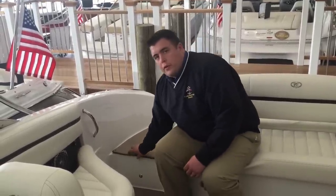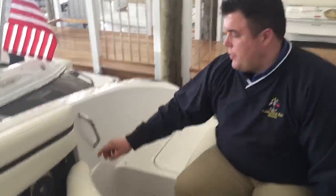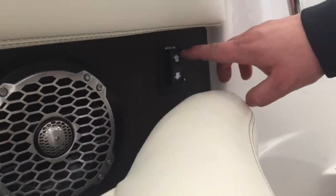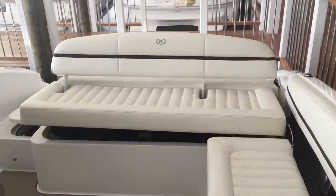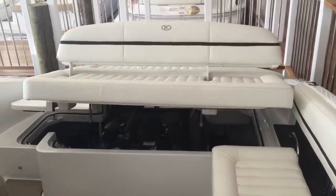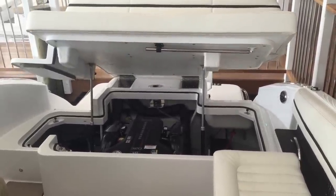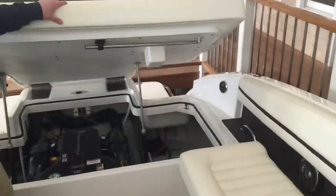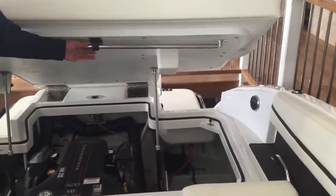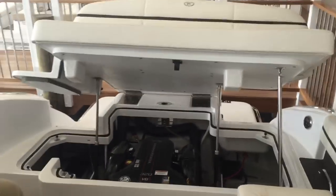Next, we're going to cover the engine compartment. If your boat is outfitted with the optional walk-through carpeting, make sure that it is unsnapped and removed out of the way prior to that. If your boat is equipped with a motor box actuator option, your switch will be over on the starboard side. Simply to raise it, push your finger on the up position and wait for it to rise up. Once the engine compartment is open with the motor box actuator, as a safety precaution, you definitely want to take the load off the hydraulic pistons. To do so, there's a safety bar mounted on the underside — simply unclip it from its receptacle, slide it into the little slot by the grommet down there, and then lower the pressure of the pistons down onto that.